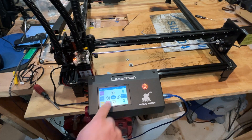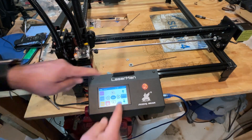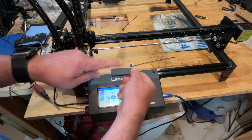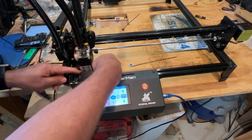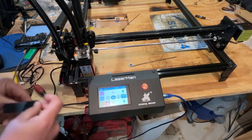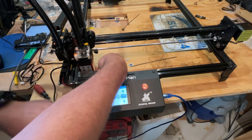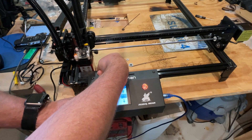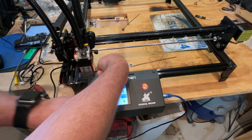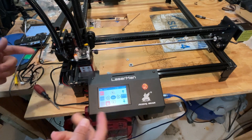I'm switching to 10mm mode and going back on the Y. This is where you use the gauge for your cuts, which is also the correct distance. I'll switch to 1mm and walk it back in until it fits in there just perfect, then switch to micro nudge. See how that balance is perfect.